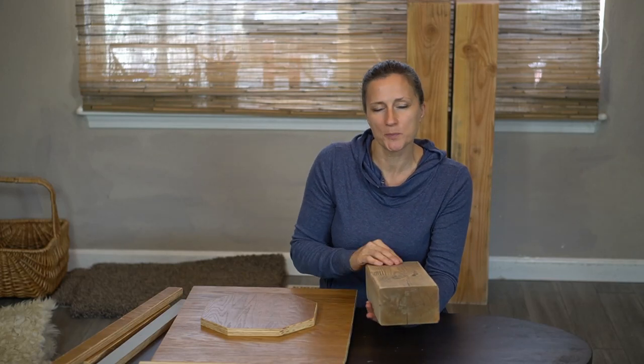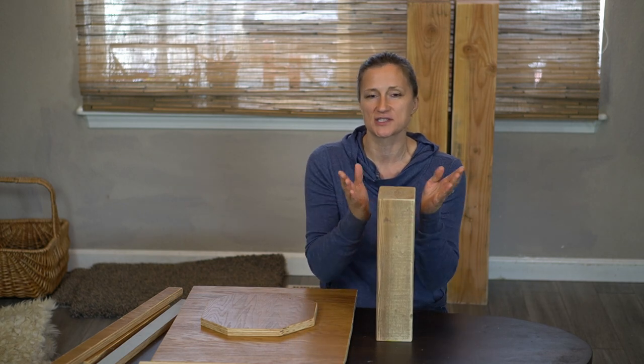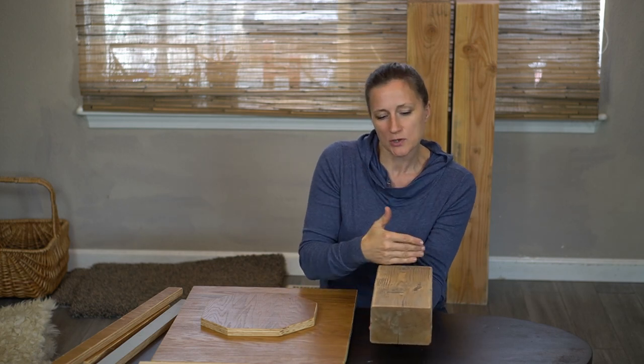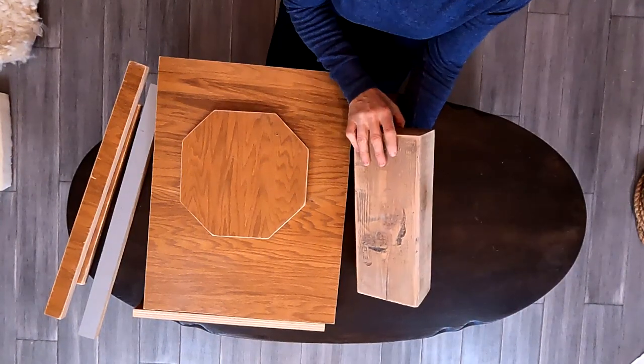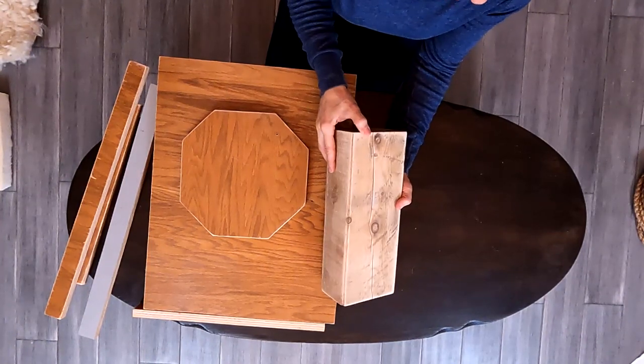In addition you're going to want to cut your posts. I did these out of four inch by six inch, so the actual cut is three and a half by five and a half, unless you're doing a rough cut wood. For the shorter one it's going to be 14 inches long, and then for the taller ones that are the main posts they're going to be 40 inches long each and you need to do four of those. I've already cut all of these and sanded them down but I left some character to it, which is really what I like because I want this to have a rustic look.